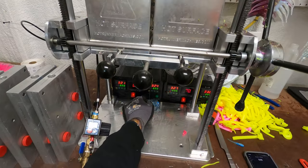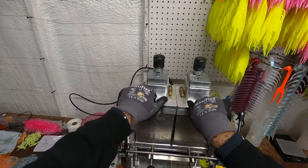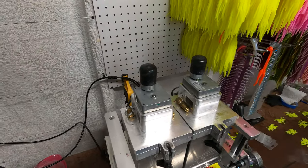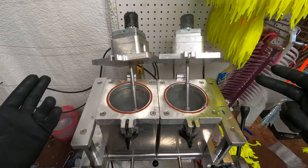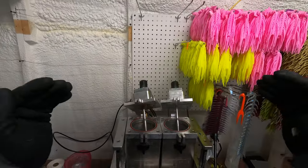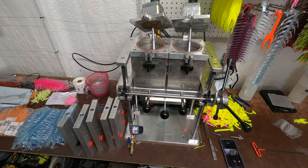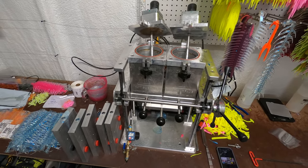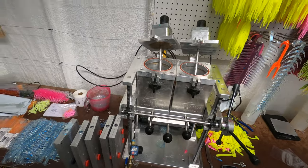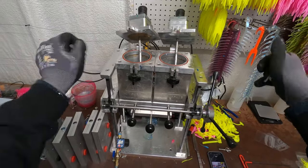I kill the air, turn your stir motors all the way down to zero, power it off and you're good to go. When I was purchasing this machine some naysayers said it's a terrible idea because you won't be able to change colors quickly — well, you can change very easily. I pull both pins just like in the assembly process, kick both sides back, and let them rest. Then I take a big box fan with hangers and blow air down into the pots — it's basically the same cooling process. The machine's already preheated, so once you get it down to about 220 you can peel the pots and it's the same process all over again. Or if you want to keep the same color, while your molds cool between shots you can run your plastic in the microwave, come over and pop the tops off, pour some more in, and you're ready to go.